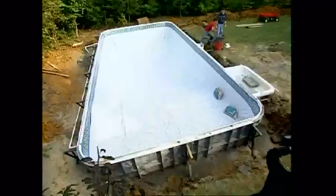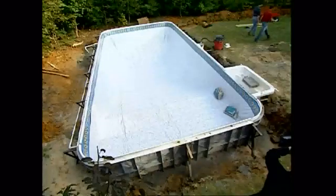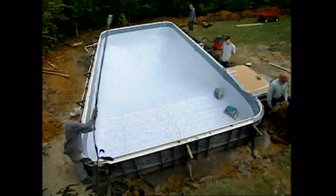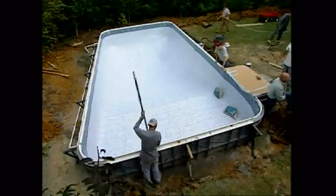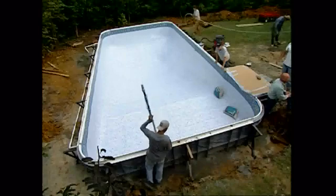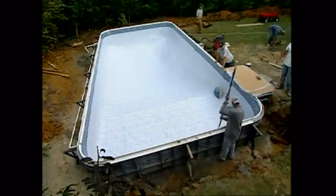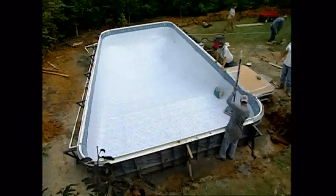We wait. As the suction starts to pull the liner down, we continually adjust the fit by pulling the excess material on the floor toward the base of the pool walls. If we can't get all the wrinkles out, we shut off the vacuum, reposition the liner in the pool, turn the vacuum back on, and start the process all over again.